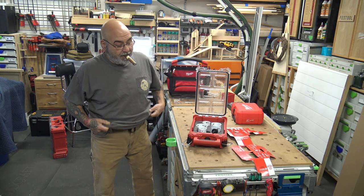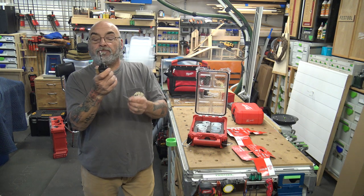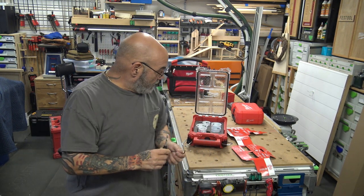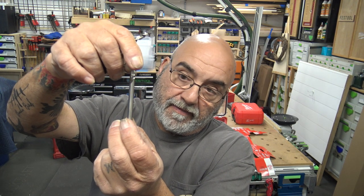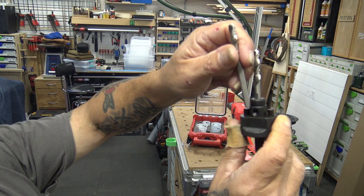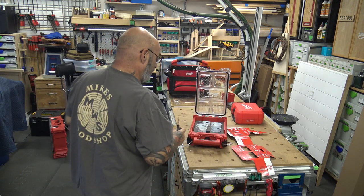It's a real nice go-to set and it's not expensive. If you're going to go through stucco — well we have done it through stucco but it kills the bit immediately. It comes with an allen key so you can change the starter bit through here. Push it up and you can't see the slot; push it down and you can put the allen key in to change the starter bit. Milwaukee starter bits have a flat side to them so it grabs — if you just throw a regular drill bit in, it'll spin. You've got to make sure the flat side is seated in and then tighten it down.